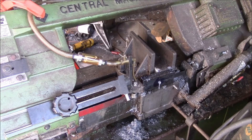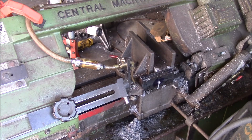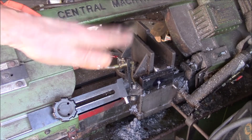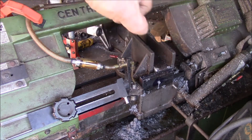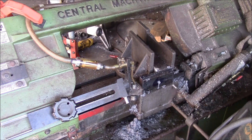The blade is cutting pretty well and one thing I notice is there's no vibration. I had to adjust the tension a few times because it kept slipping off the drive wheel, but I think I've got it tightened up now. I'm not getting the intermittent vibration during cutting that I used to get — before, the whole saw frame was jumping and you could actually see it moving. That started a couple years ago; maybe the crack was starting to affect it, with the wheel getting a little loose and jiggling around.